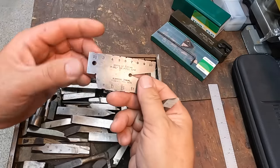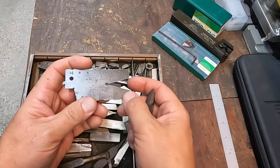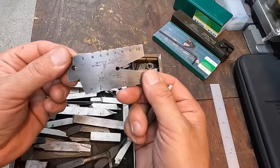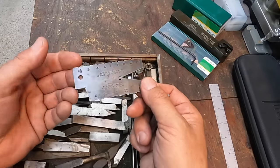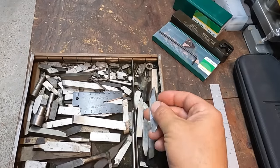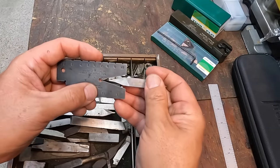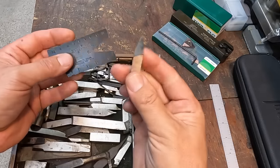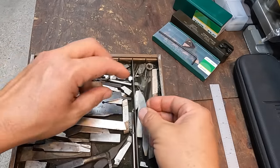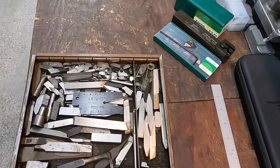All right. So another good way to do it for you guys that are learning about this shop work and trying to do this stuff yourself, pick up one of these Acme thread gauges. They're not very expensive. You can probably get them used off eBay, and some inexpensive high speed tools. Practice grinding these, and you've got yourself some Acme tools. All right, but we're going to go with the carbide insert for this job. Let's go down here and get her set up.